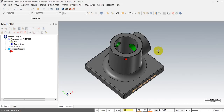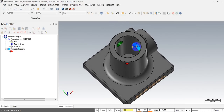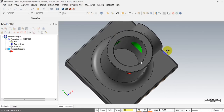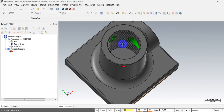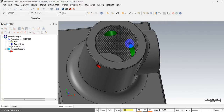I will show you one method to do that. I will use a Mastercam 3D flowline toolpath and a lollipop cutter to remove the burr from the holes. I have a sample part here — you can see we have some cross holes. For example, I have this big hole already machined in a reverse step, and we cannot change the machining operation. This hole must be done first, so after that we machine this green hole and drill this red hole, so we get a lot of burr from here, here, and here.